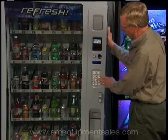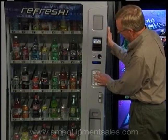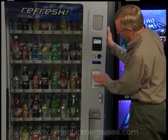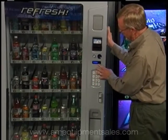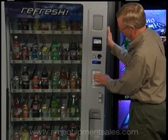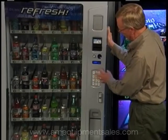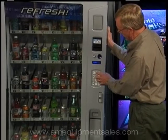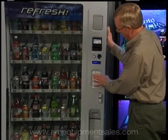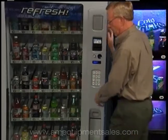Button one will bring you back out to the main menu. Scroll down to calibration and button four enters. Under PDC software maintenance, take button two and scroll to discovery, hit button four. Level zero comes up — hit button four again to get the zero to flash, button two moves us to level two, and button four enters. Now it's saying 'Please close the door.'